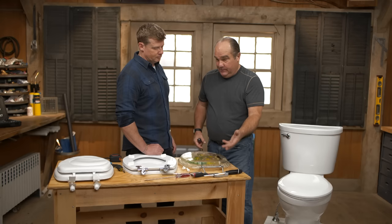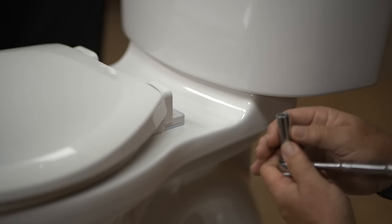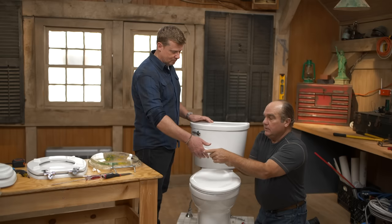Where we see issues is on old seats like this. This is a brass threaded piece — there's a nut down the bottom. Over time, they've been in for 50, 60 years since Elvis, and urine and liquids can really corrode that. So what you've got to be sure to at least try is to have the appropriate deep socket to come up underneath and then try to work it. But many times it just will not come off — the nut will actually corrode in place and you're locked in.